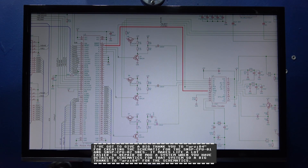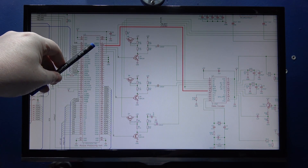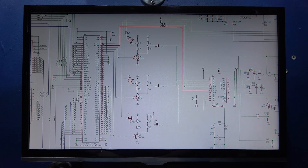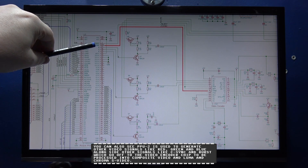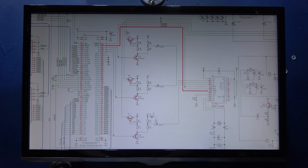What I want to do is quickly show you on this SNES model schematic where CSYNC is generated. If we look at this big chip on the left, this is PPU2, and if we look at pin 100 just here, we can see CSYNC. So that is where CSYNC is generated by the PPU2. Now what I've done is marked the trace in red just so it's easy to follow. If we follow it, we come along, go straight down, and go straight into the video encoder chip on pin 8. Looking at PPU2 and the CSYNC signal coming out of it, I can see the label telling me that it is active low - when you see a line across the top of the label like this, it tells you that it's active low. What that is telling me about the CSYNC signal coming out of this PPU2 is that it's at TTL level.